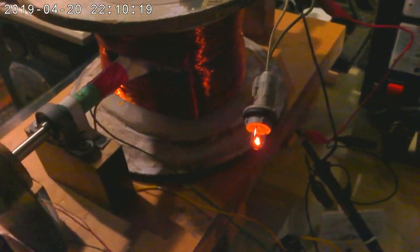So anyway, we've got 380 volts going in there now, and a power consumption of about 4.5 milliamps at 380 volts. So if I load it down with my hand now, that will jump up to almost, I've got to squeeze quite hard to do that, 20 milliamps, but obviously the motor's slowed down quite a bit.